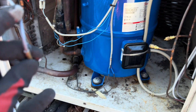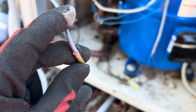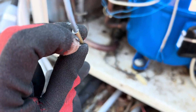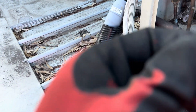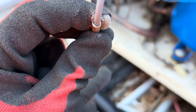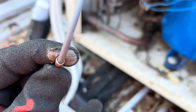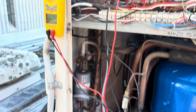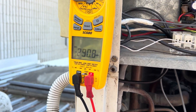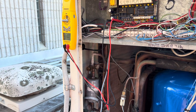Just pulled the sensor to have a look — you can see at the top it's usually that nice black sealed top to keep moisture out, but this one is just completely open. So that's confirmed — sensor needs replacing. Testing whether warming it up changes the voltage out of the board, but nothing. It's too far gone.